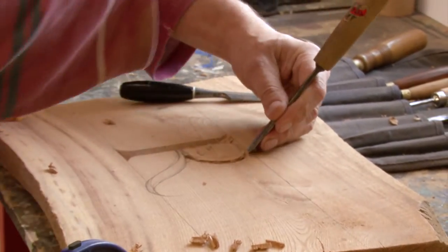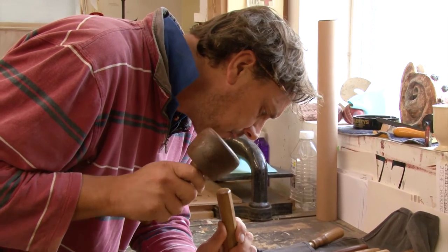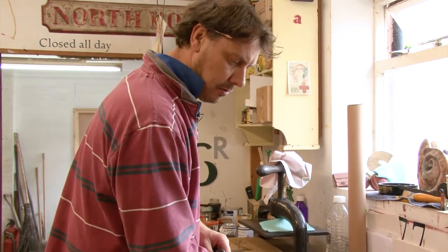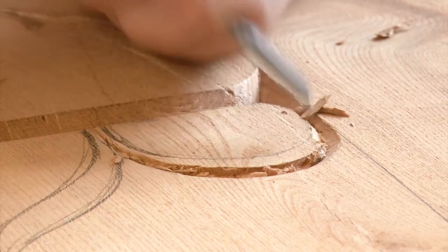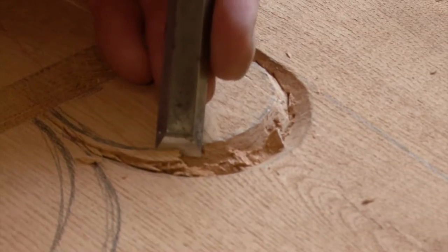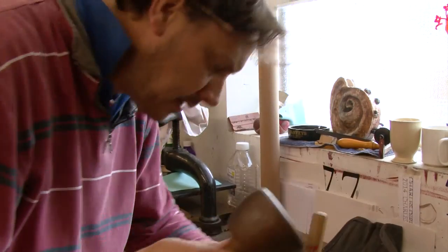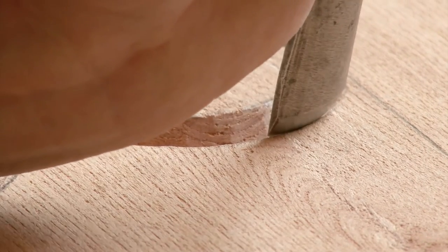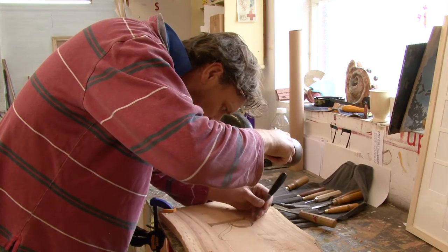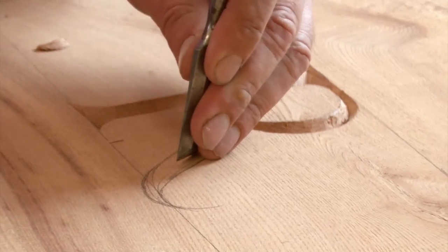This piece of elm has got reasonably straight grain for elm — it swirls, and that hints at its quality. Because of those swirls you don't get a straight split, so that's pretty much the outside of the bowl done. I'll just work around the inside now and use a slightly narrower stroke as well. Then I'll go back to the gouge, and chop the center line of the arm stroke.